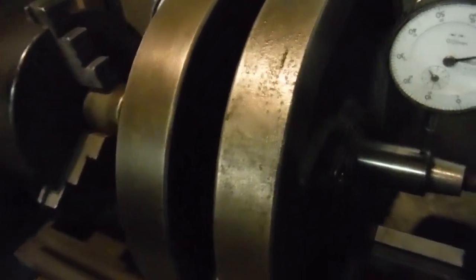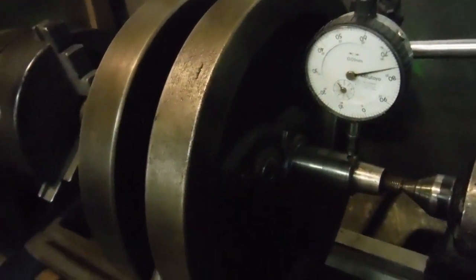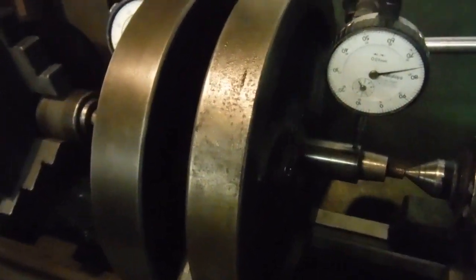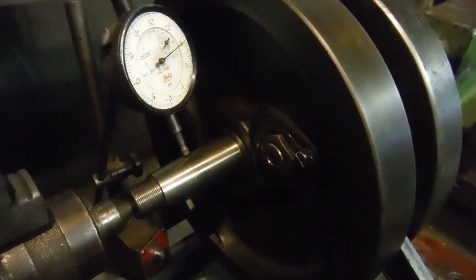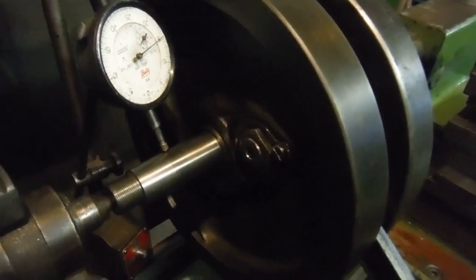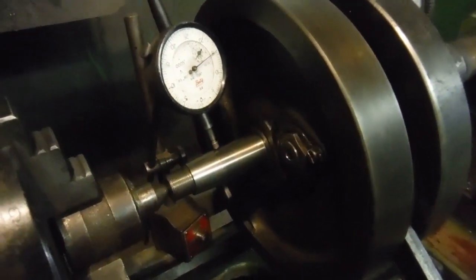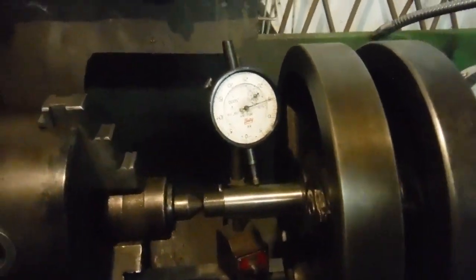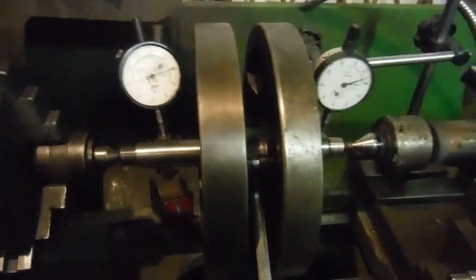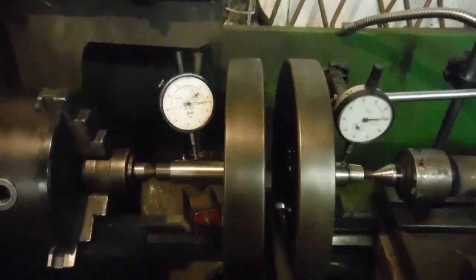It all went together nicely and trued up nicely. The nuts on the end of the crank pin are done up tighter than they were when I dismantled the original crankshaft. I was wary about overtightening, because you're pulling a tapered hard steel pin into a cast iron flywheel — theoretically you could tighten to a point where you'd get a crack in the flywheels, which was the last thing I wanted. Using a bit of common sense, the nuts are done up nice and firmly and the flywheels are nice and firm against each other.